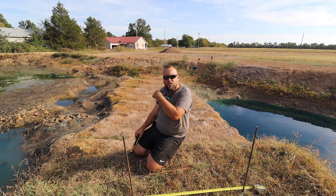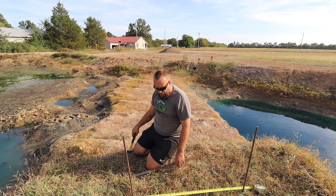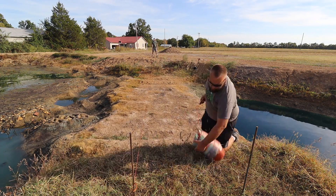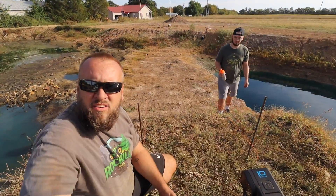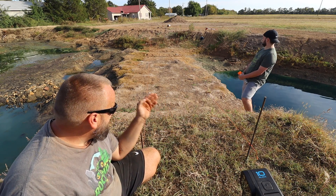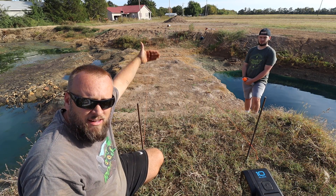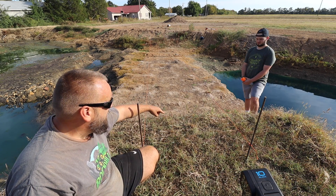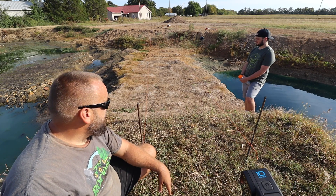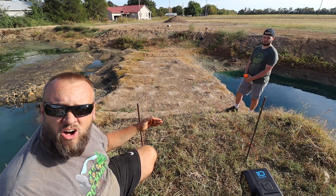I have a sense of urgency to get these piers put out in the middle. I'm going to put concrete here too, but that can wait because this needs to be done before we get any rain — this is the only time this center section is probably ever going to be dry again. The bridge path is going to be over 40 feet long and the space between the actual banks is 36 feet. We're going to split that into thirds: 12 feet from the edge for the first pier, 24 feet for the second. Then we'll square the whole thing off once those points are in a straight line.